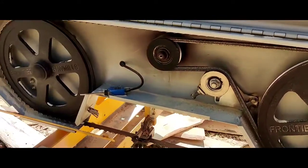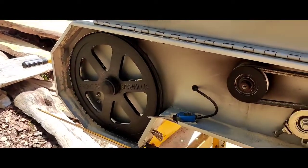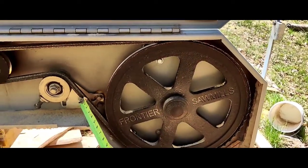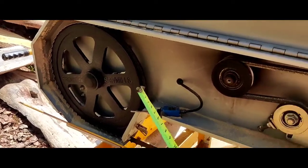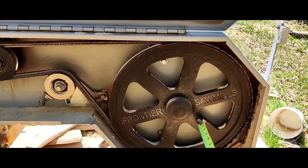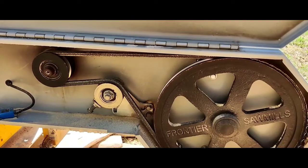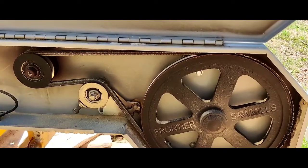When putting the belt on, I use this pulley to adjust the tracking of the belt, and I track the blade with the other pulley. You can make minor adjustments to blade tracking with this pulley, but you don't want big changes — if it goes out of line with the drive pulley, it'll twist your belt, throw your blade, damage it, and cause all kinds of trouble.